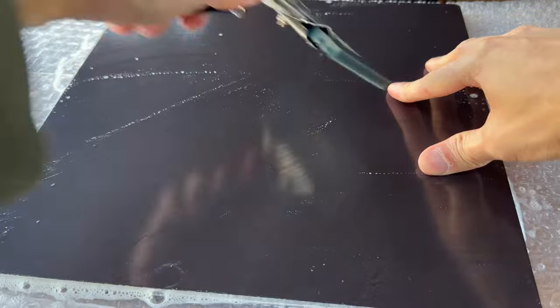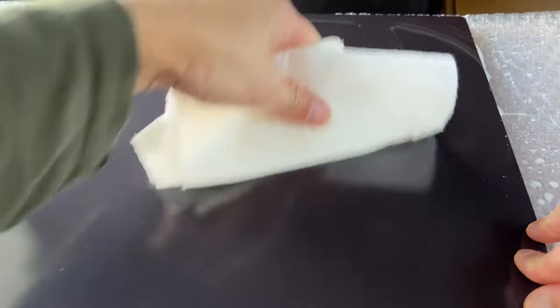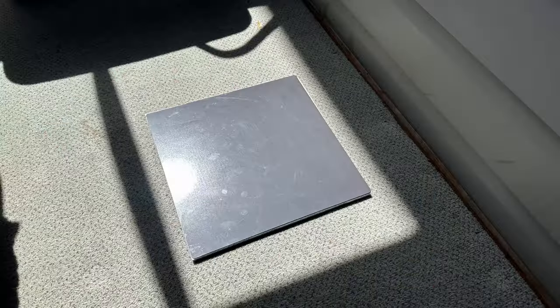Check the edges to make sure the magnet does not overhang the sides. Finally, wrap a hard plastic card in a paper towel and repeat the squeegeeing — the towel will soak up excess moisture. This is a thick magnet on a flat plate, not some flimsy film on curved windows, so there shouldn't be many problems. For insurance, rest a weighted object on top while it dries. If impatient, you can use a heat gun or hair dryer to speed things up.